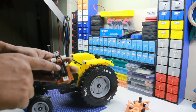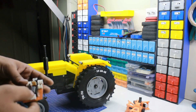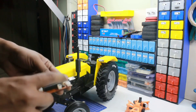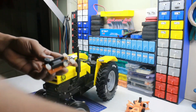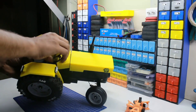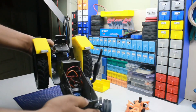L293D for motor driver — one motor for driving, another you can use for PTO, then one for lift servo and another for steering servo, left and right indicators along with battery supply, front lights, and Bluetooth connection. So the wiring is already done.